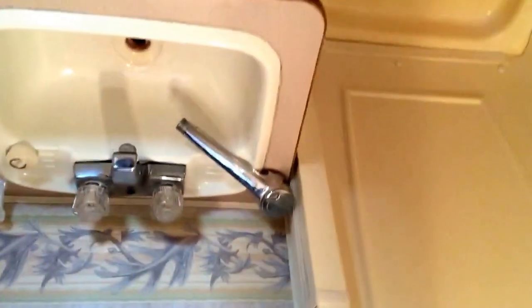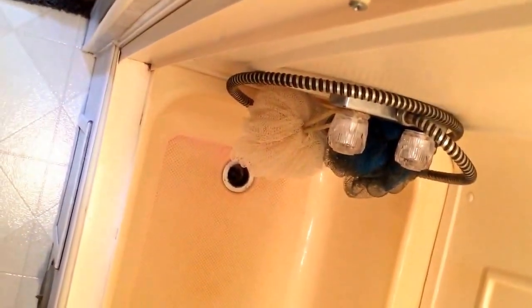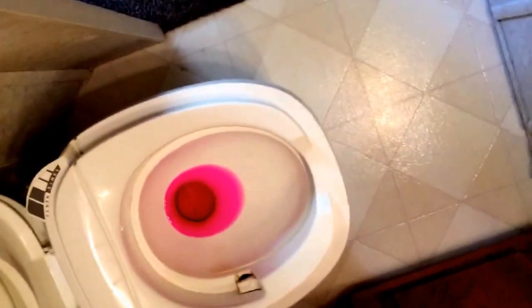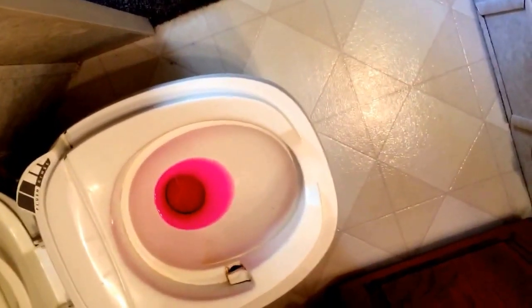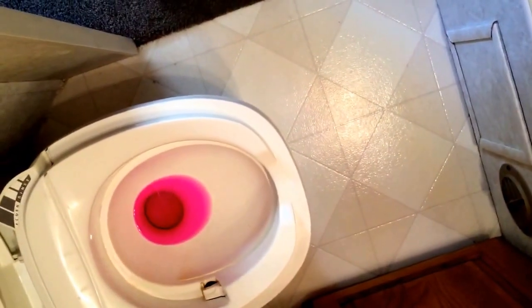Something I do: I take my shower head off, make sure it's drained, and put it at an angle so everything runs out. I wrap the hose up. I've blown out all my lines and put antifreeze down all the drains. But what I also do is leave antifreeze in the toilet — the seal right there that keeps it closed so nothing runs out and no smell comes back up. It keeps that seal moist. So when I come back in the spring, pop it open and all is well.